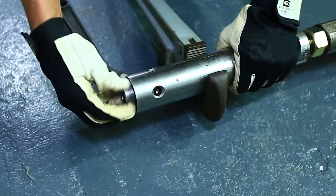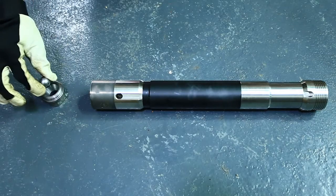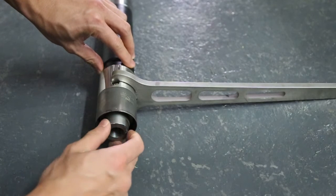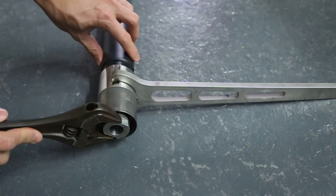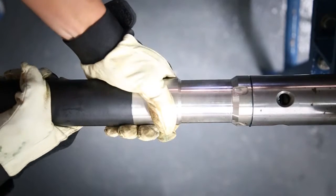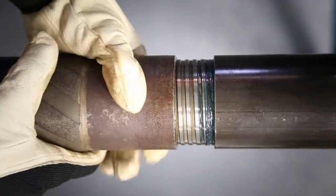Start by removing the check valve and ball from the two head assemblies in use. Assemble the valve and the ball in front of the DEVICORE units. Attach the head assemblies to the back end of the DEVICORE units as shown here, then attach the inner tubes to the front end. The core barrel extension may be fitted between the front reamer coupling and the core barrel.